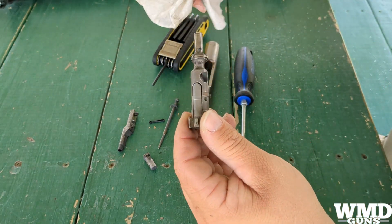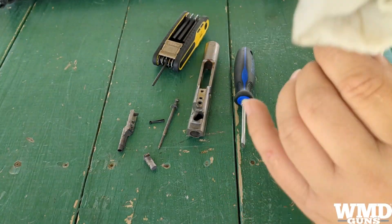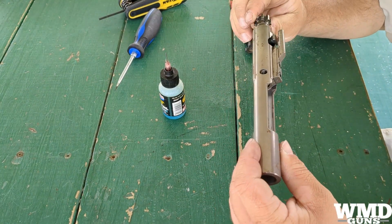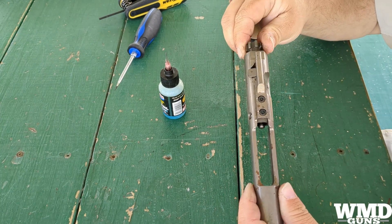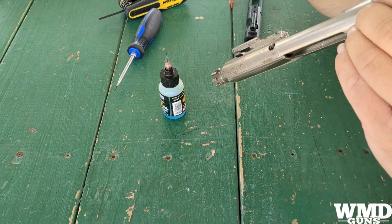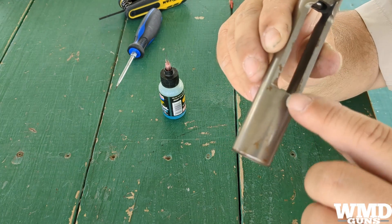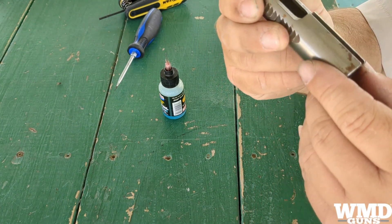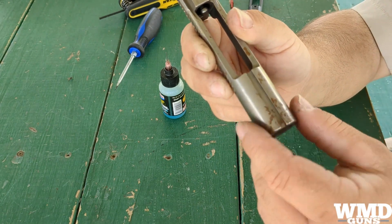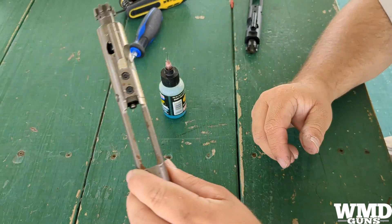I'm going to wipe it clean, oil it up, reassemble, and see how it goes. You can see it's wiping clean pretty easily. Even that rust in there didn't seem to be all that hard - it came right off. We're all back together and oiled up. Much smoother than it was before. I'm going to oil it up a lot more before putting it back in the action. Some of this might just be surface rust stuck to the outside of the boron and not so much the bolt itself rusting. I'd expect to see more grit and wear at the back where the bolt slams against the buffer. I'm also going to pull out the buffer and see what it looks like back there.